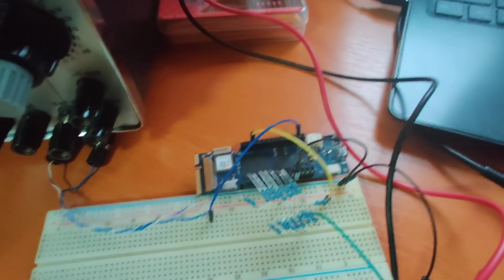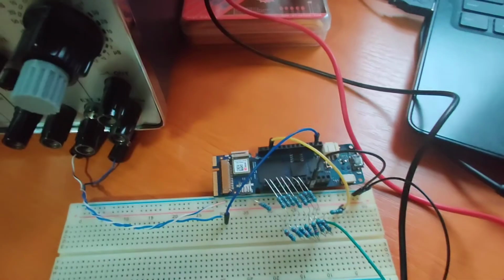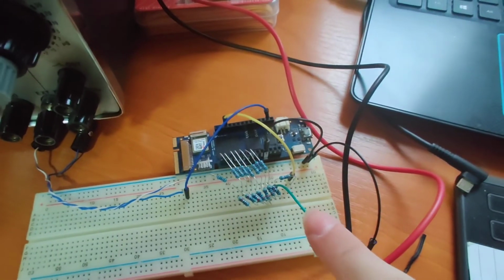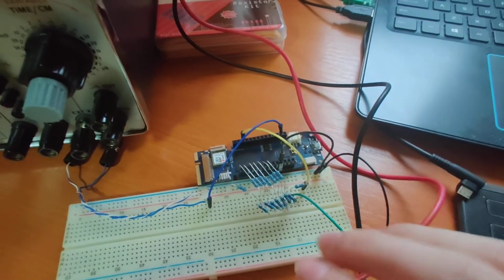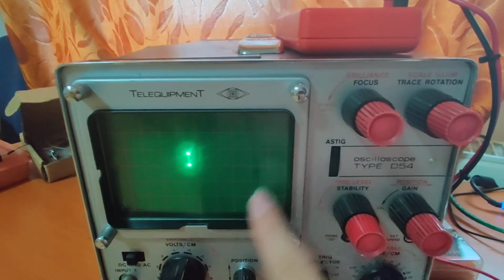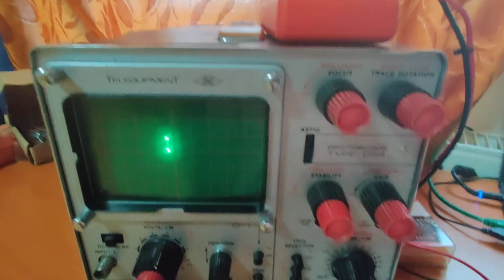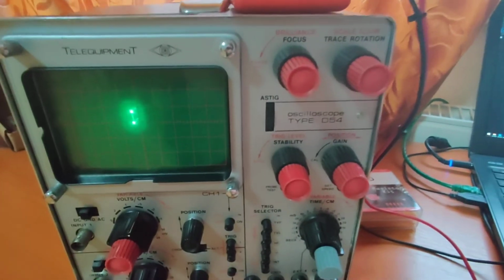And by quickly sending matching values, one on the blue wire and one on the green wire, that match to some coordinates on this, like in 0.5 volts, which will map to a position on the screen, I can basically move that point in whatever pattern I want, and it will draw something.